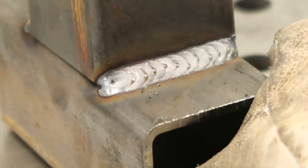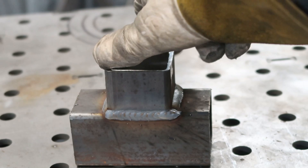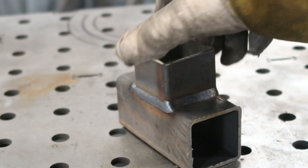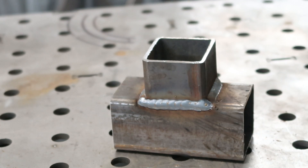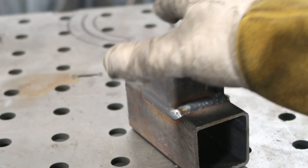And that does not look too shabby. We got a good clean weld — barely any spatter, just a couple little beads. Looking at the arc shots, there's a gap to fill but it's filling in real nicely. This is our first coupon with factory settings and it burned in real nice. There's not a lot of soot, barely any BBs, just some on the starts. Since it's plugged into 110, it's got a little bit of a cold start, but for the most part it looks pretty good.